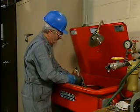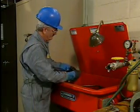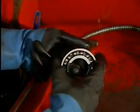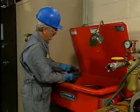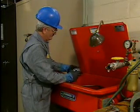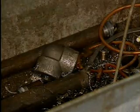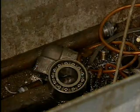After the bearing has been removed, the mechanic cleans it thoroughly in a solvent bath. Once cleaned and dried, the mechanic inspects the bearing for signs of wear, spalling, and discoloration. He rotates the bearing rings slowly to make sure they turn freely. If the rings turn hard, bind, or drag at any point, the bearing should be inspected further for dirt or other obstructions. This bearing shows no signs of unusual damage and has simply worn out from normal use. To prevent it from being mistaken for a new bearing, the mechanic disposes of it according to company procedures.